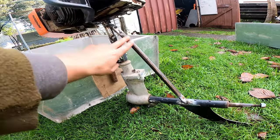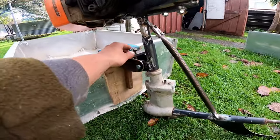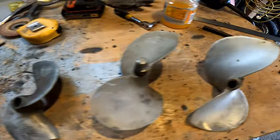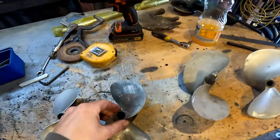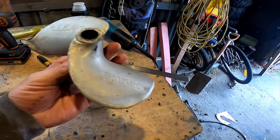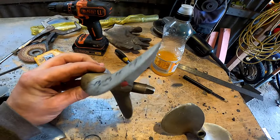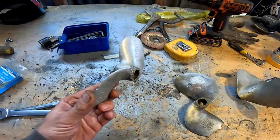I've put all those parts together. I've got a big brace down here, and a brace at the bottom to hold this piece, with a bolt here to adjust the pitch when it sits in the water. Now I've got to decide on a propeller. I've got four surface props: a six-and-a-half inch, an eight-and-a-half inch that's broken, a nine inch which I mostly use on my other longtail, and a super aggressive one about the same size — that'd be the fastest, so I might start with that one first.